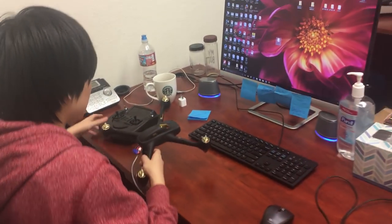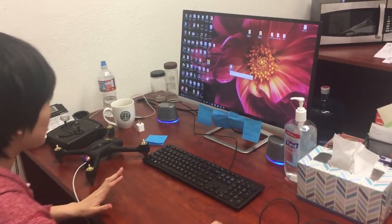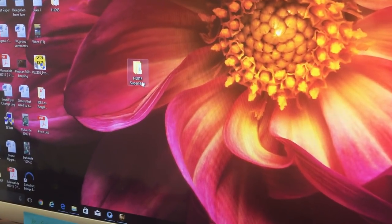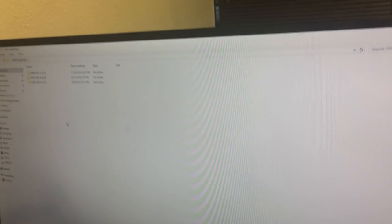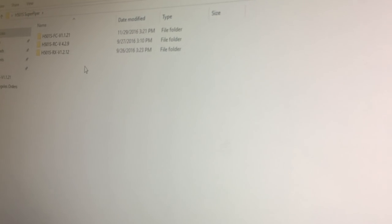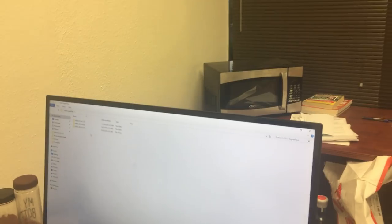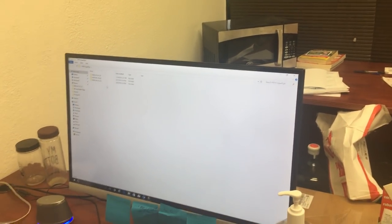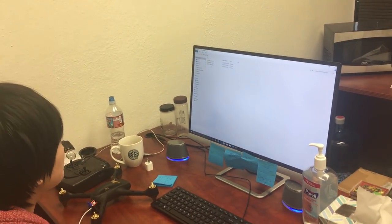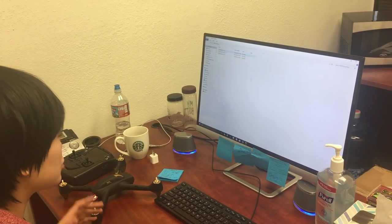You heard the computer respond to that connection. Once it's plugged in, go ahead and access your firmware file. I'm using the Superflyer file here. I've separated the firmware into three easy-to-access folders. For any firmware upgrade, don't look at the firmware version numbers first — first look to see that the file you're choosing corresponds with the part of firmware you're trying to upgrade.